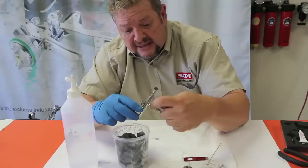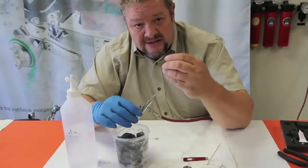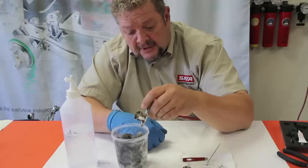Because the O-ring that's in the air valve chamber is made of rubber — they can't make those things out of Teflon because it's too rigid and it doesn't seal. So we do not want solvent getting back to the end of the gun. If that needle is out of the gun, make sure you have the gun tip very much forward.